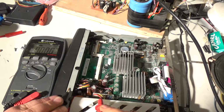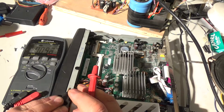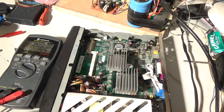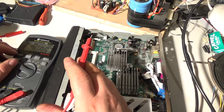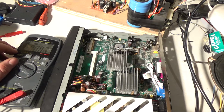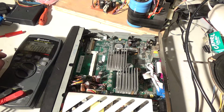So this is what I'm going to do. I had no issues with the 7905 in that circuit. Let me turn this off. Okay. I can substitute the -12 for the negative 13 on the VECTREX. So I'm going to use this power supply instead, and I'm going to run a 7905 off the negative 12 volt line, and that should give me all the voltages I need.